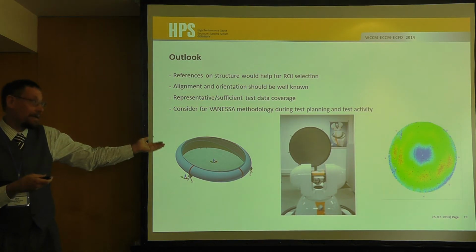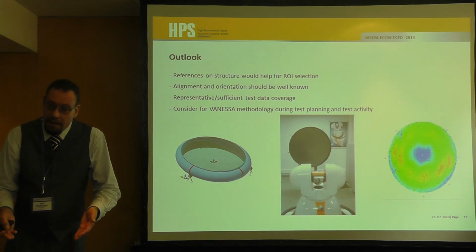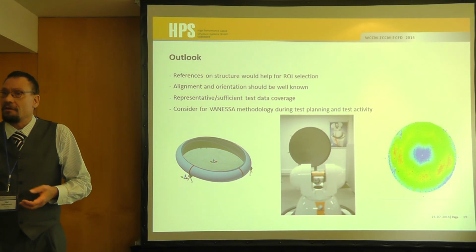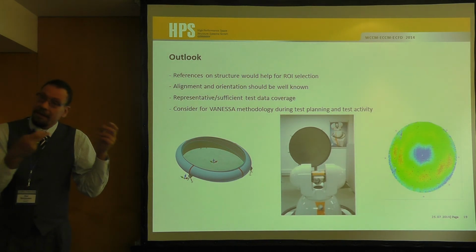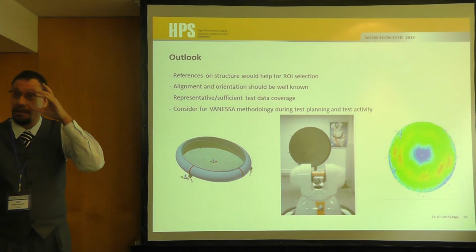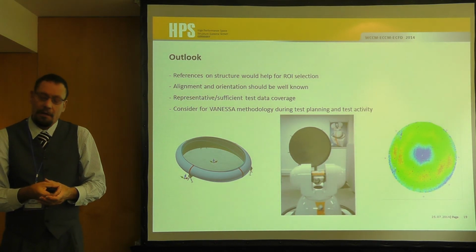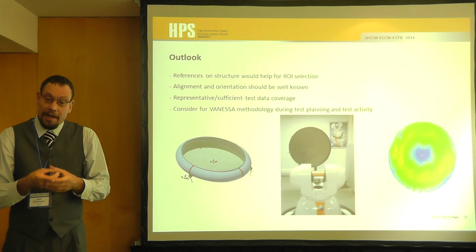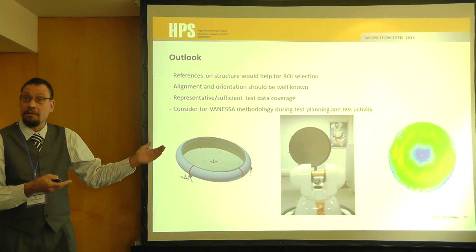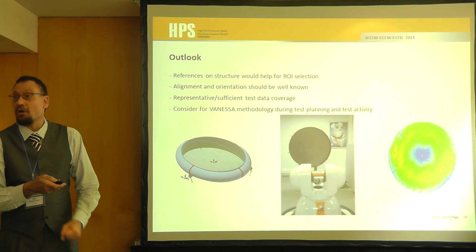As you can imagine, again, it's a thermal theme. In this chamber, you only have a gradient during your heating or cooling phase, according to the different capacities. In simulation, for the orbit, we have to do many different gradients according to solar impact or going into the eclipse. So when we can have the validation of our model according to the measurement, which we can on Earth, we have confidence that the product also will work in space very well.